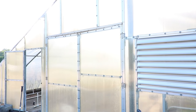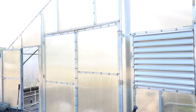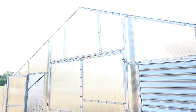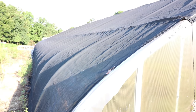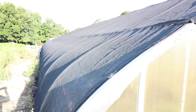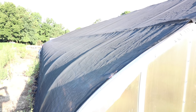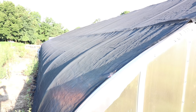Here's a view of the front. The end walls are made out of polycarbonate, which is a very strong plastic that should last years and years. The front of this greenhouse is about 14 feet at its middle peak. Here's a view down the length of the 72-foot-long propagation greenhouse. It is covered with two layers of six-mil clear plastic and then a shade cloth layer over the top to keep it slightly cooler in the midsummer months.